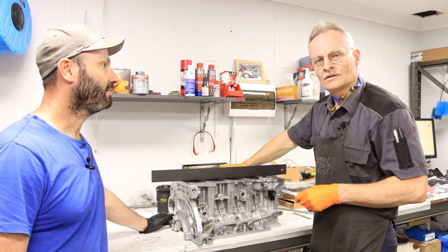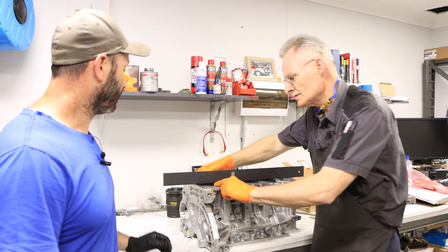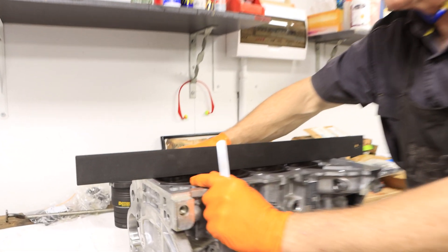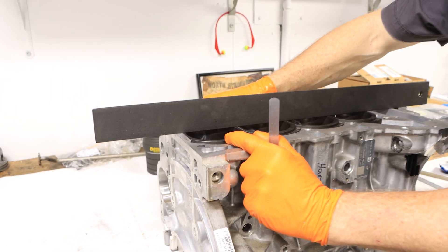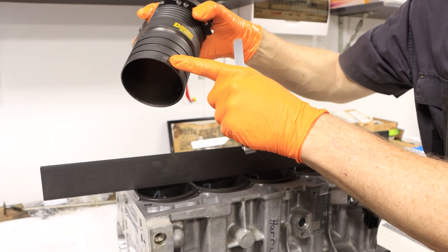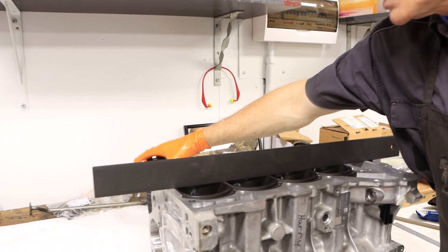So basically this is another good installation like the other one was. We allow that interference at the top collar area here in the block — that's why we've got to drive it in. We want that interference at the top so we don't get any movement possibility whatsoever. The actual seat contact with the block where the seal is, is at the bottom of the cylinder liner on this face here, and then we've got our three sealing rings stopping any coolant getting through the oil wetted area.